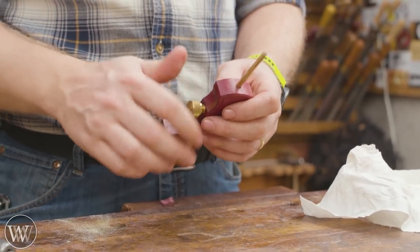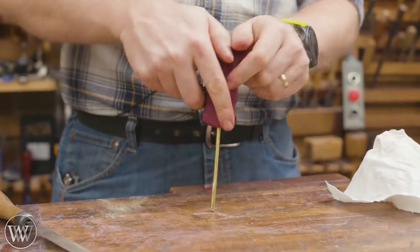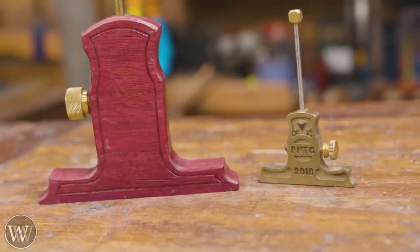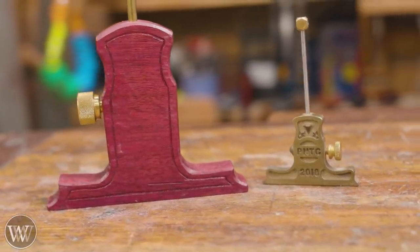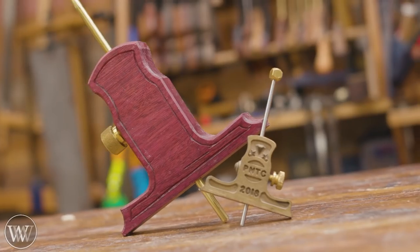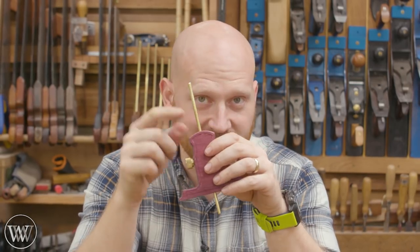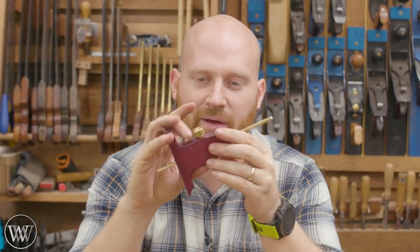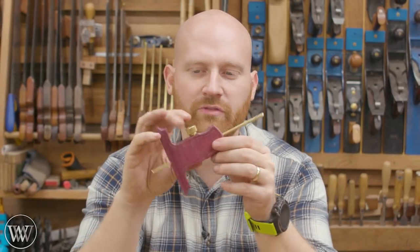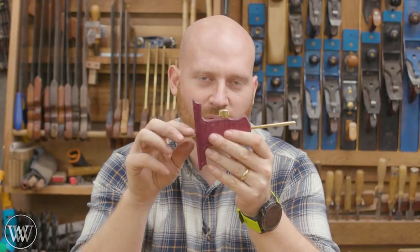Throw in a thumb screw, put it on down, and you've got your piece. I'll leave a link to all the hardware down below if you want to make one for yourself. It's a little bit stiff going through that hole because the holes didn't line up quite perfectly, but it's close enough that it actually runs really well. So you'll probably be seeing this from time to time. A depth gauge really comes in handy anytime you're doing a mortise or a bottom groove. This is a little tighter than I like but I think it'll open up over time, and once you set it close to where you want it you tighten it down and it is not moving — so it's a very confident depth stop. It was a fun experiment, drilling a long hole all the way through accurately is a good skill to practice.